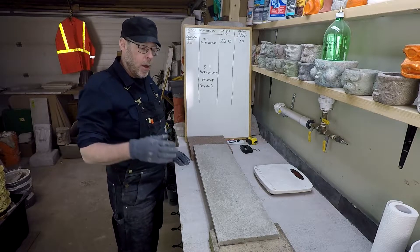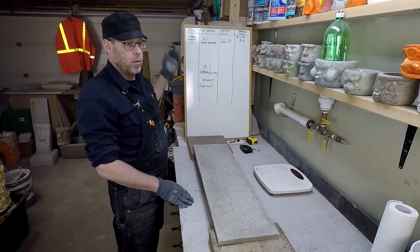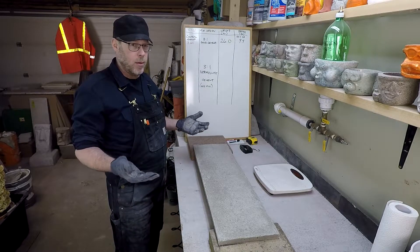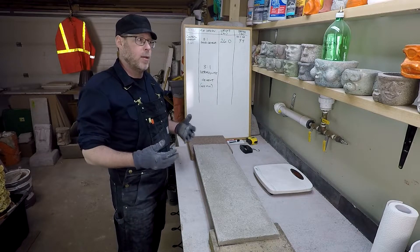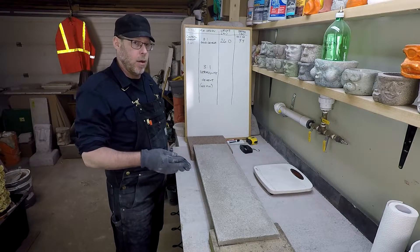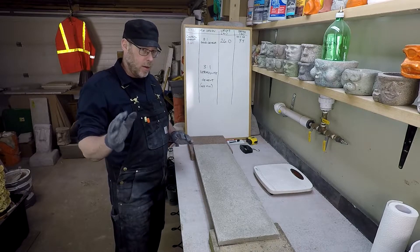This test block is totally impractical — it would be expected to break. It's too weak as a configuration. Even our full-strength concrete control group only held 94 pounds before breaking, because there's no steel reinforcement in it whatsoever. What we're trying to do is identify properties of lightweight concrete mixes that can make something stronger, or that accidentally make things weaker.